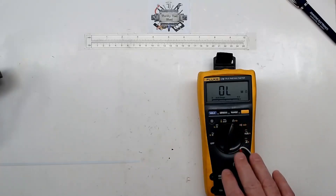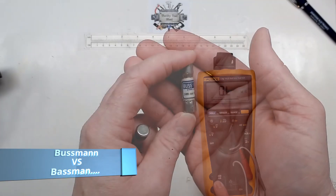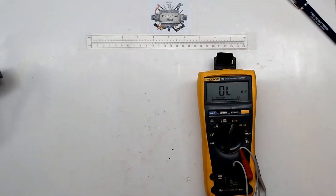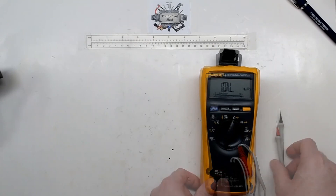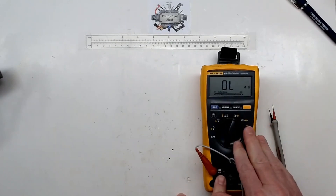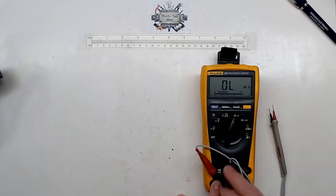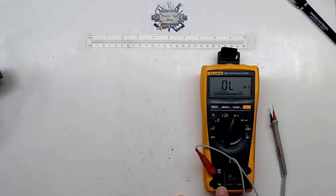Today we're taking a quick look at multimeter fuses, specifically the 400 milliamp fuse known as the DMM 44100, which gives a 10% over-range of 440 milliamps. It's easy to accidentally switch to your 400 milliamp range and blow the fuse — either by having more current than you thought, or forgetting you're on that range. For measurements below 100 milliamps, I try to use the milliamp scale, and for anything above half an amp, use the 10 amp rating.